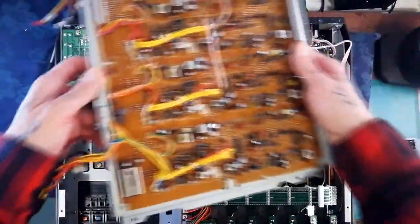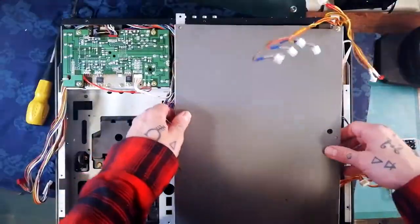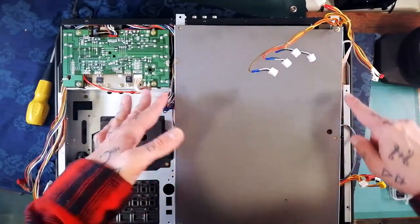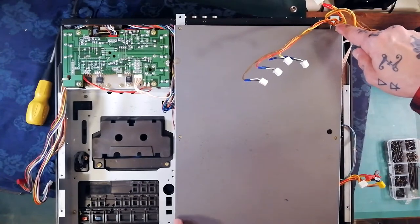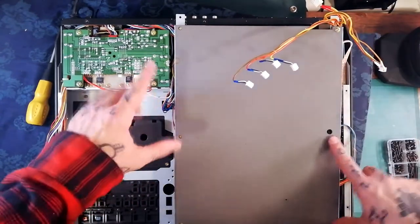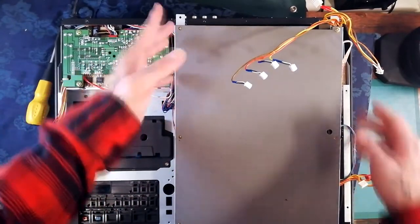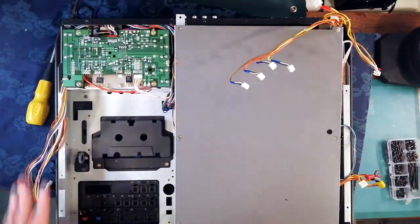At that point it's completely detached. Should you need to access the rear side of this for desoldering, the shielding is held on by two screws at the diagonal corners; the other four screws are attaching the PCB to the metal brackets and there's no need to detach them.